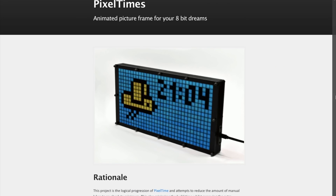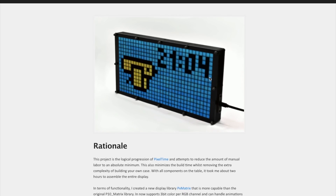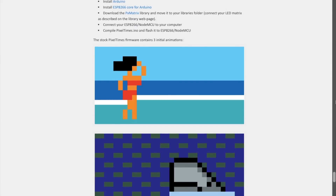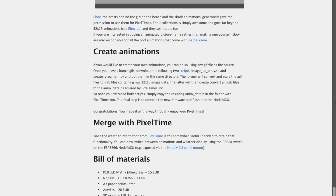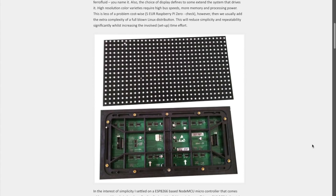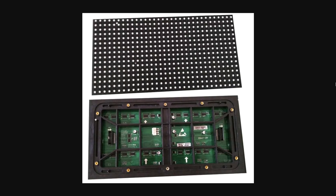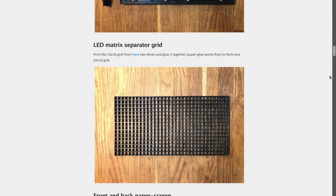Dominic Buckstaller has a write-up on version 2 of his Pixel Times display. It's a 32 by 16 grid of multicolored pixels that works as a clock or a weather station or just displays cute pixelated animations. The design is built around what's called a P10 LED panel, commonly found as part of a large electronic billboard. It's a loose grid of addressable LEDs and they're cheap — around $15.